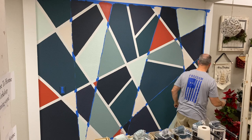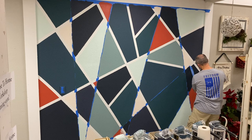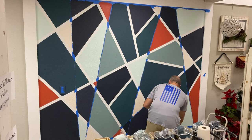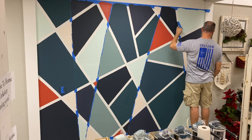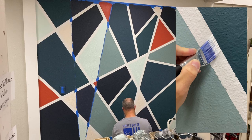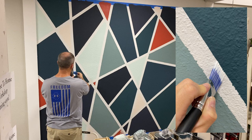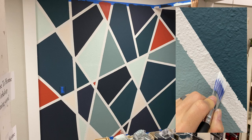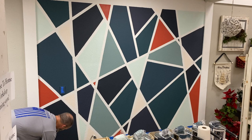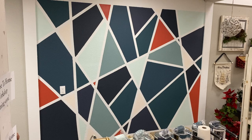There's really no way to tell if you're in a space where the wall has been painted over time and time again what's underneath. So go into it knowing you might have some touch-up. I'll have a short video on how I did the touch-up. Regarding tape type — I used blue shop tape. I've used Frog Tape before but it sticks so much that when there are layers of old paint on a wall it can sometimes peel the prior paint right off.